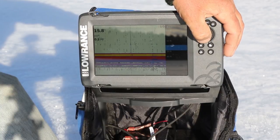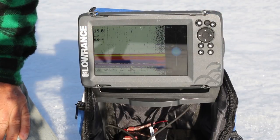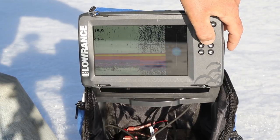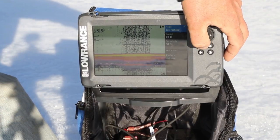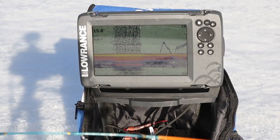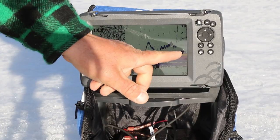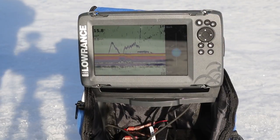When you're in a boat moving around it does change. Sensitivity is very important. The higher the sensitivity is, you're going to get a little bit more return, but you're going to get a lot of stuff you don't want on the screen if the sensitivity is too high. So what I try to do is just match it to what the water clarity and depth are. Right here, for instance, 37 is a really good sensitivity level — I'll show you why when we drop this jig down. See, that jig's already on the bottom and we're going to lift it up. As long as you can see your jig, you'll be able to see the fish just as easy. See, there's a fish right there on the bottom.